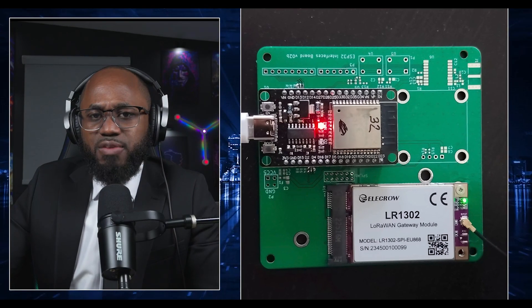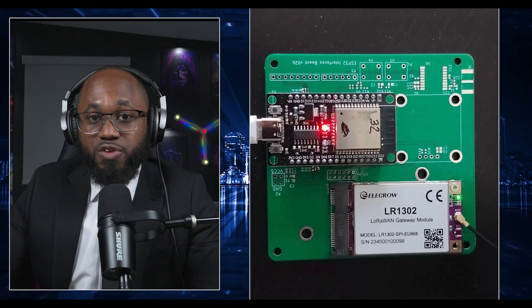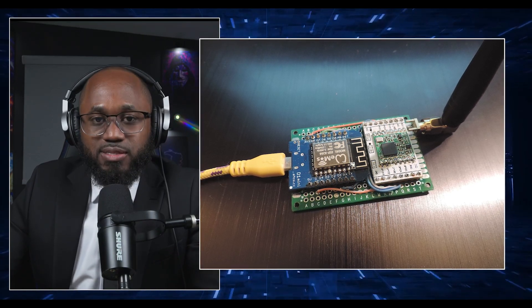You'll also need LoRa antennas. The power source is a LiPo or Li-ion battery, optionally with a solar panel for off-grid use — supporting up to 18V or 2A solar input. Optional but recommended: a GPS module or wing for location features, and USB-C cables ensuring data capability. For the software environment, have Python 3.9+ installed on your computer. The MeshTastic CLI is used for flashing firmware and configuration — install it in a Python virtual environment for cleanliness. You can also use the Arduino IDE or ESP-IDF for custom code if not using MeshTastic.